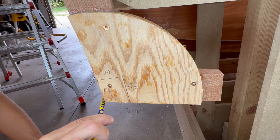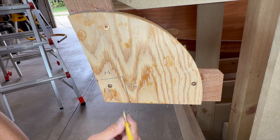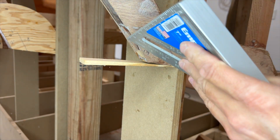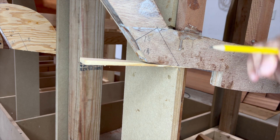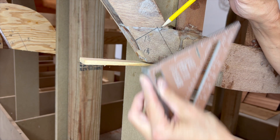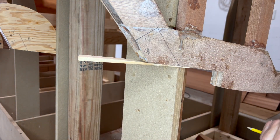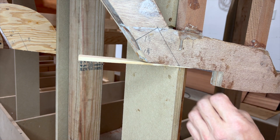Since I'm using this edge, this has to come down further because to have it meet up here the whole rectangle is going to be two and one eighth inches — so you can imagine it's going to come out here and I'm going to have to sand it down. Now at the transom I want the board to be flush to the back of the boat. From the bottom corner up to here is one and three quarter inches tall, and I've drawn a line basically perpendicular to get it squared off one and three quarter inches deep. Where would it meet and be a one and three quarter inch deep board? Way down here — and that line will now be three and one half inches.